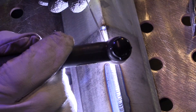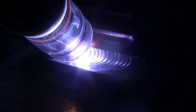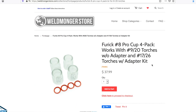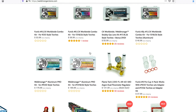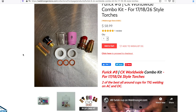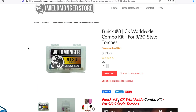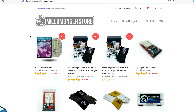This cup did a great job. Here are a few clips from previous videos — here's when I was welding a cube on aluminum using the same 8 clear cup. It's a good all-around cup for both steel and aluminum. The real benefit for me is it just lights things up and helps me see better. If you think it might help you and you're having a little trouble seeing where you're going, go to weldmonger.com. They've put together some convenient little kits that have a ceramic as well as a clear cup for each torch — whether you've got a 17, 18, 26 or a 9, 20 style, there's a kit just for your torch along with visual aids to tell what kind of torch you have.